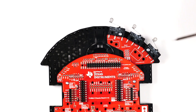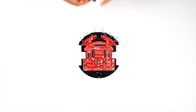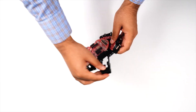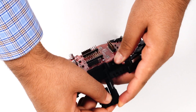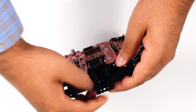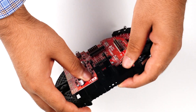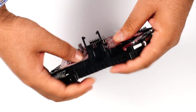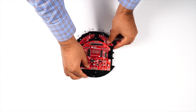Repeat the whole process for the other bumper switch. The motor clips are identical, so either clip can install on either side of the base plate. Make sure you push the clip all the way in — you might hear a click before it's fully seated, but notice if the retention tab has not yet seated on top of the battery compartment. Keep pushing until the bottom of the clip is flush and the retention tab has popped over the battery compartment. Repeat for the other clip.